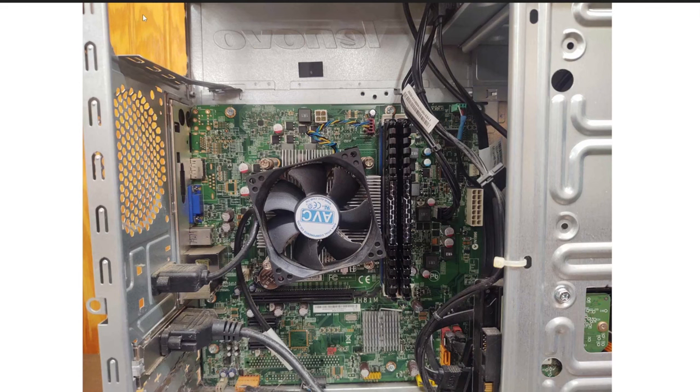Here's what the motherboard looks like. The power supply goes in this hole up here at the top. Here is the 4-pin connector and here is the 14-pin connector. This big green piece is the motherboard. Underneath this fan is the processor — this is a heat sink and fan for the heat sink; it keeps the processor cool. These two things are the RAM, also known as DDR. The hard drive is down at the bottom right, and up top we have an optical disk drive, or CD drive.